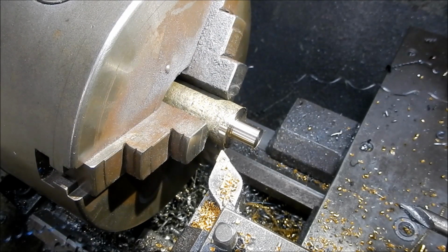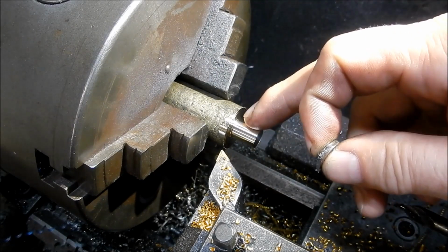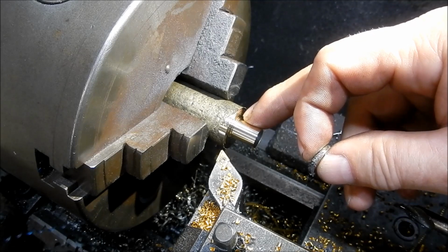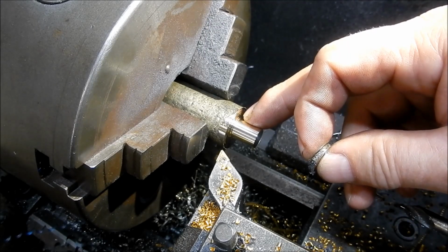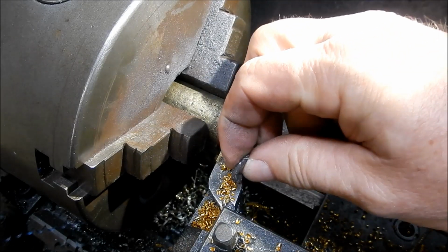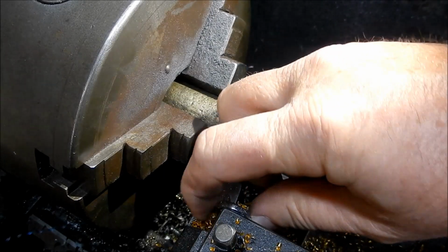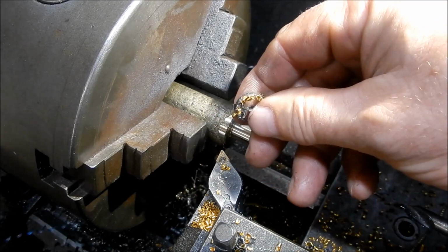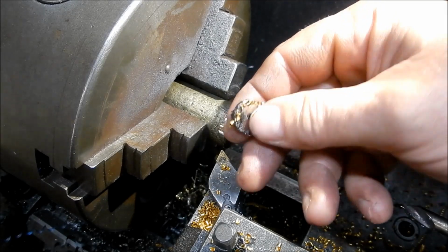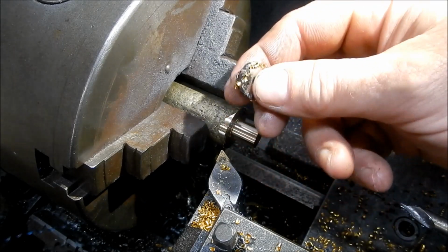Just a little trick. If you look at aluminium bronze, it's got a goldy colour. Now, apart from aluminium in the mix, and it's only a small percentage of aluminium, it has around about 1-2% of iron mixed into it. And the way you can tell aluminium bronze, if you pick it up and you want to do a little test on it, is get yourself a little rare earth magnet, just pop it on, and you'll see it's actually magnetic. Get it off, it attracts the chips. So often if I go to a scrappos, I'll take a file and a little piece of paper, file a section off with my little rare earth magnet underneath, and if it moves the filings around, you've got aluminium bronze.